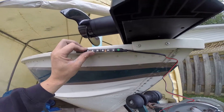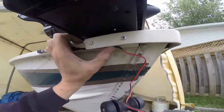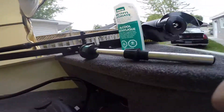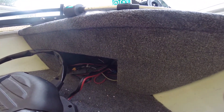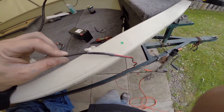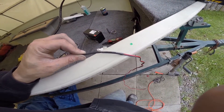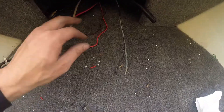On this boat I'm going to position them right here. This cable will tuck up nicely under here, then feed through and out where I can wire into the existing wires. I added about another two inches of shrink tubing on there just to protect it against the bend that has to rub against the aluminum. You may have to add more depending on your application, or you may not need any.